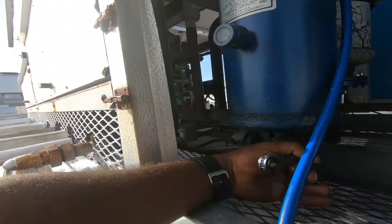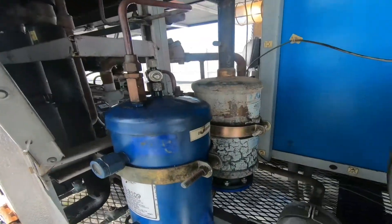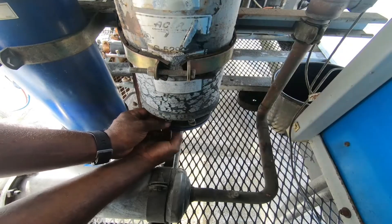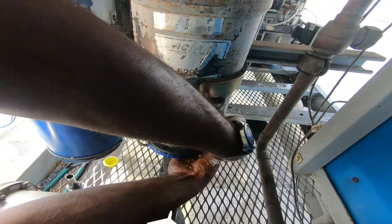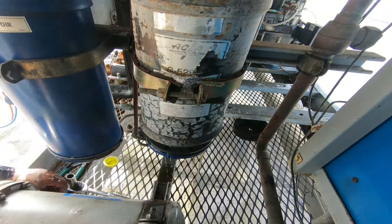We don't want to lose any gas on our suction side - this is going out to the oil pots, so I'm going to valve this down also. We've got everything valved off. I'll loosen these up - just kind of broke them free. Put my bucket down there to catch. As you can see, we got some oil starting to come out - this is where my oil is trapped.